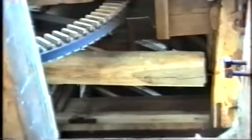That's the top bearing for the Quant, which is serving as a resting point for one of the RSJs that are currently holding the mill up. Unfortunately, we can't gain access to the stone floor because the ladder's gone, and I might be able to find something to climb up on a bit later. You can see the broken side girt there, and also a transverse RSJ resting on a vertical half pole prop. Also a little bit of the iron mortise tail wheel up there.